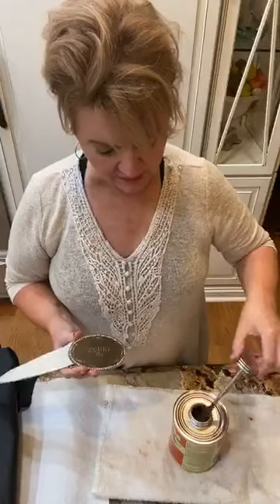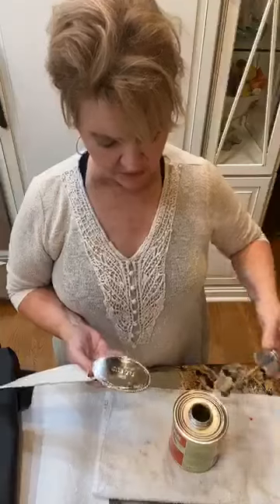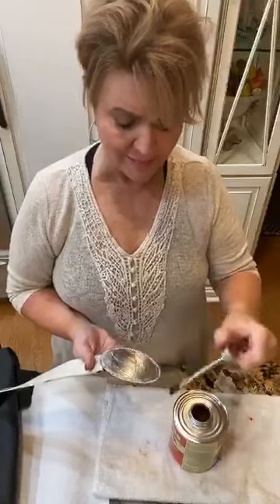We're going to do two different things to this. First off, on top of this metal, I'm going to go ahead and take the lid off the barge cement. This stuff is pretty smelly — it's like a rubber cement on steroids. This is a glue. You don't want to leave the lid off any extended time. Using a thin coat of this glue, you're going to brush that right on top of this metal or anywhere you're trying to stick something. I'll share the link to barge cement if you're interested. I bought this on eBay of all places.